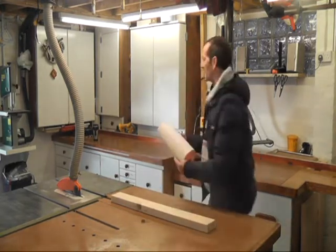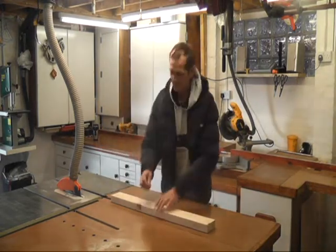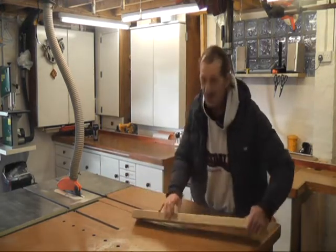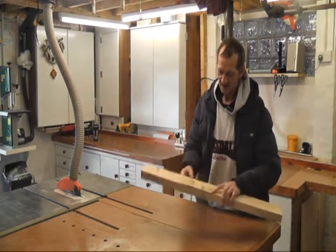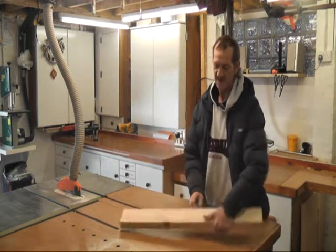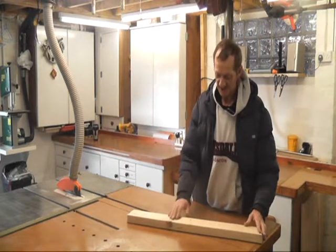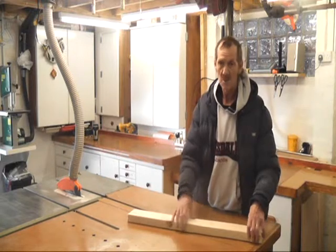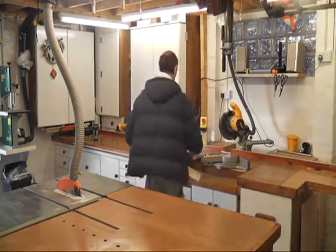Okay, let's start off with the wood first. First off, just looking at it, we've got a big old nasty knot in there. I don't want that, that's going to be really horrible to work with. So, I've still got enough left. I'm just going to rip it across there and then we'll start working on this bit here. Chop it up into four pieces, that'll give us the four sides of the frame. Then we can rebate the back out, put some shape on the front, and so on. Okay, rip that down first.